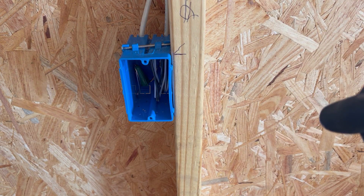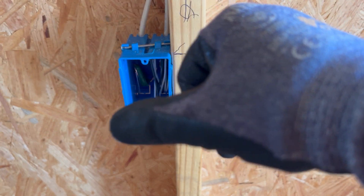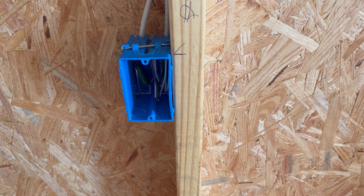So there's the one. Put the ground together, put the wire nut, cut your wires so they're about six inches hanging out so it's not a big mess in the box — it's all you need. And then on to the next one. I'm going to do a time-lapse so you can see how quick this is.